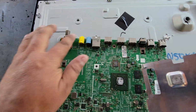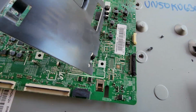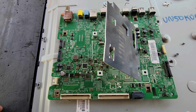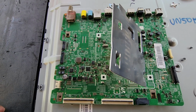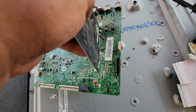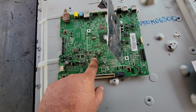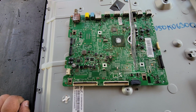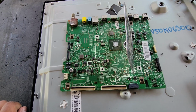But all the stuff would have to be masked off everywhere. And then when it's done, that's your weakest point of entry, and that's how boards still fail through conformal coating and other types of treatment. But when you use a product like NanoflowX, where it's literally a dip process into a liquid bath, should I call it, and comes out. And funny thing is, it only takes like 5 seconds, and then it goes into a heat oven, a lab oven, for about 15 minutes, I believe it is, and at the right temperature. And at that point, it gets extremely cured.